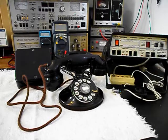John wants to upgrade the transmitter and the receiver of the E1 handset because he has low transmit and low volume. In this type of E1 handset, they have a diaphragm style receiver capsule and a graphite granule transmitter. This type of equipment will pull more voltage out of the telephone line than a newer style receiver capsule and a newer style electronic amplified transmitter that we design and build here at the shop.